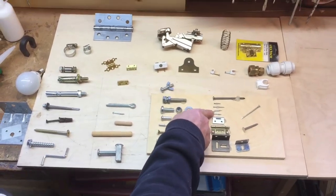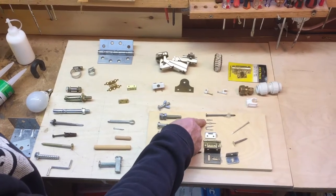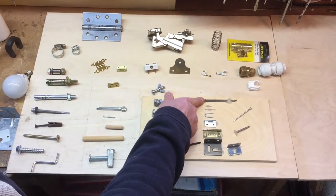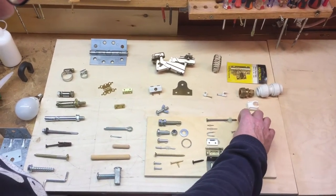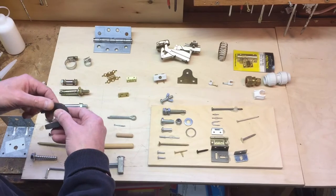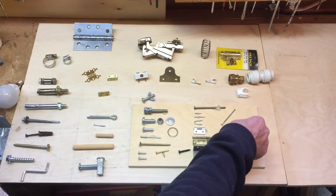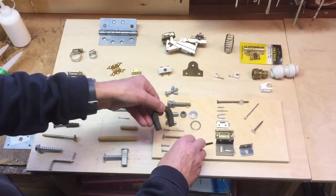You've got wire nail type fittings — there's a bent one, a hooked nail for wiring, and little panel pins, often steel which can rust, used for small box construction. For larger construction, some nails are covered with galvanizing or plating to stop them rusting. Nails used outside are aluminium and won't be picked up by a magnet. Anything with steel tends to corrode. Brass is used for lots of little jobs, screws and fittings.